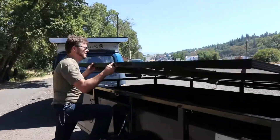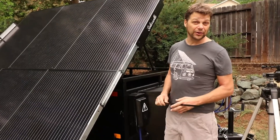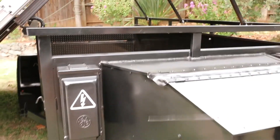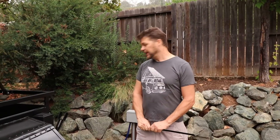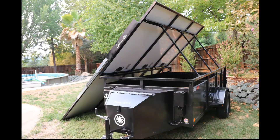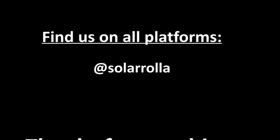That gives us 1860 watts, so this is a good sized system for the battery backup. It'll put about 50 miles into your EV each day, should you want to use your trailer for that. It would be standalone — basically your charger would come right off of there. In fact, in that kind of situation I may mount the charger in a nice neat spot so it becomes a pull-it-in, set-it-down setup. You could pull it with your EV wherever you need to go and charge as well. So that's about it — thanks for watching!